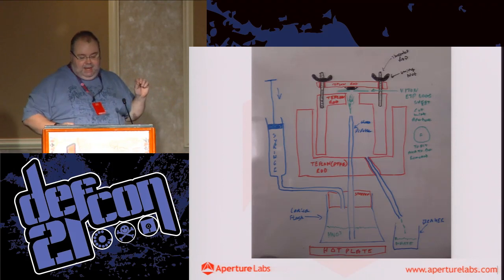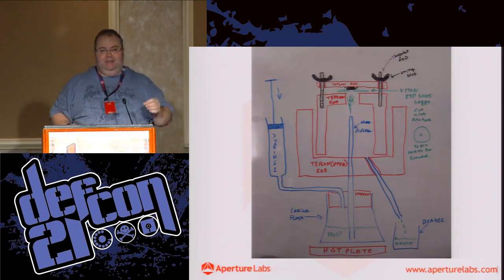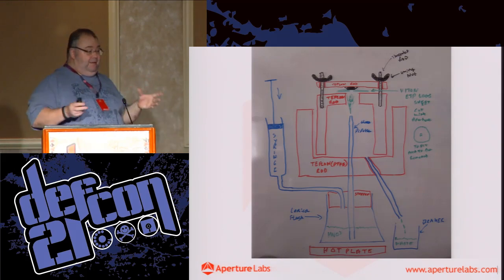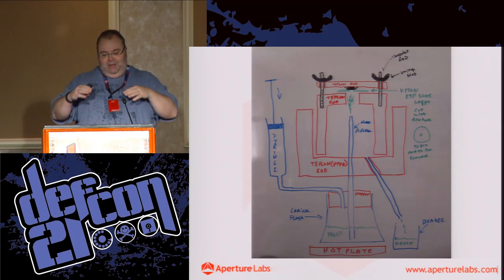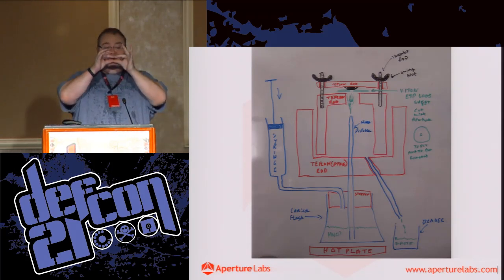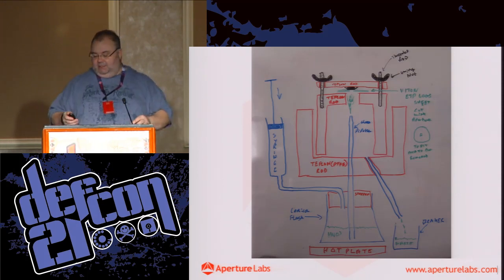And I also realized that once you cut the aperture in the Viton, a handy thing to do is to super glue it to the chip. So therefore it becomes a kind of monolithic thing, and the Viton isn't going to be slipping off the chip, etc. And I ended up using little strips of Viton with the hole cut in the end, so you could put it in and line it up with the aperture that the acid is going to jet through.